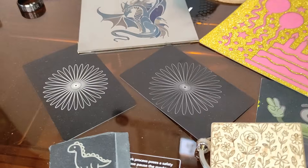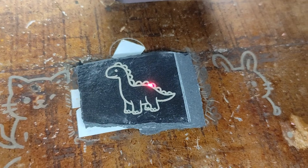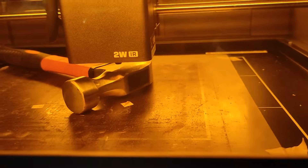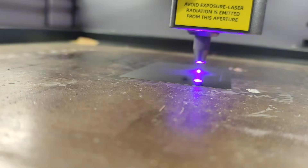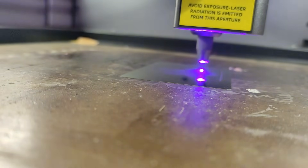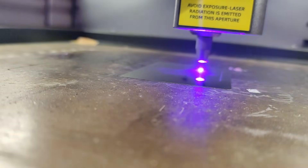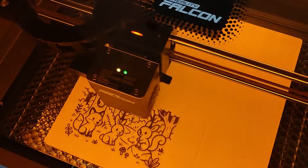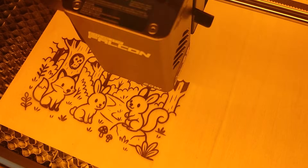For example, anodized aluminum — and not just metal, but also slates or bright-color plastic — the IR laser will have a stronger effect than the diode laser, which more melts the material than darkens it. But keep in mind this is only a 2-watt module, so you are more in the speed range of 200 to 1,000 millimeters per minute, whereas a 20-watt or 40-watt diode laser on wood can go much faster — 10,000 millimeters per minute or even more — especially on the Falcon A1 series with its lightweight CoreXY movement system. The IR module is an optional addition to the A1 Pro.